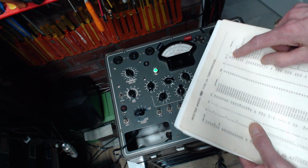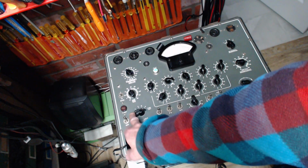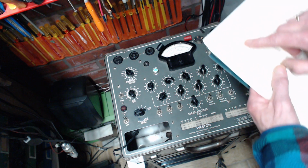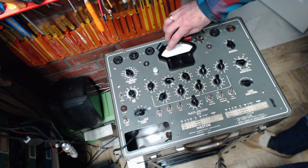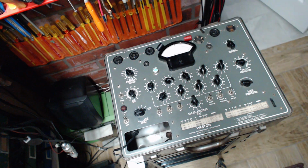What the F indicates is when you do the short test, you get around to position number 1, it'll indicate a short, but it's not a short. It's just what happens with some tubes in this tube tester. Reject point 520. So on this test, the pointer should rise above here. Now we are having trouble seeing the scale there. I'll fix that.